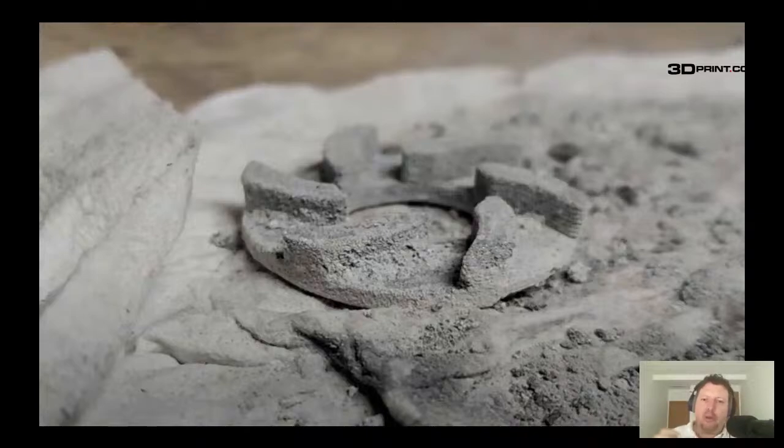What you do is you put your to-be-sintered part inside of it, and then you put it in a commercial microwave, and then you blast that microwave at 600 watts. And then it will do this work for you, and you don't need an oven. Potentially it could actually be faster, simpler to do depending on where you are, or much more accessible to a lot of people, because they don't have the commercial ovens, but they do have a microwave that could do this kind of output.